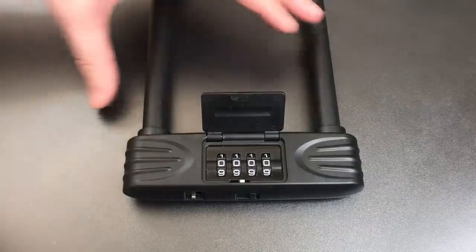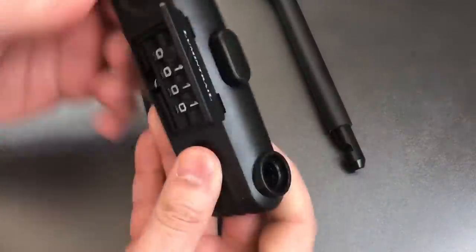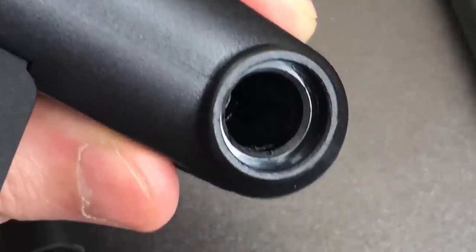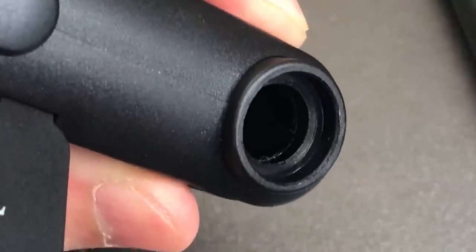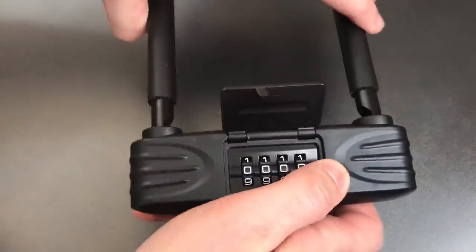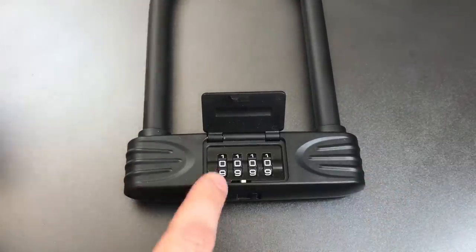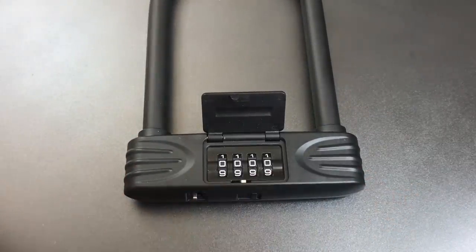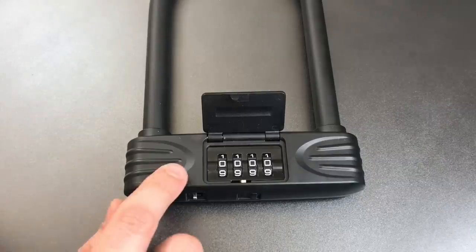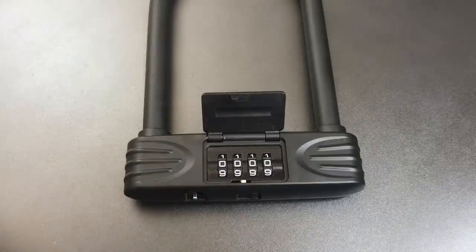In video 629, I discussed how this lock was built and expressed some concern with what appears to be a zinc clamshell construction underneath this plastic — and hopefully you'll be able to see that down the shackle hole. There's a lot we can take advantage of there. First, zinc has a relatively low melting temperature, which means with a normal plumbing torch I could probably turn this lock body into a puddle. Zinc also happens to be a relatively weak material, and the clamshell construction is also not very strong — it's probably just held together with a couple of rivets.